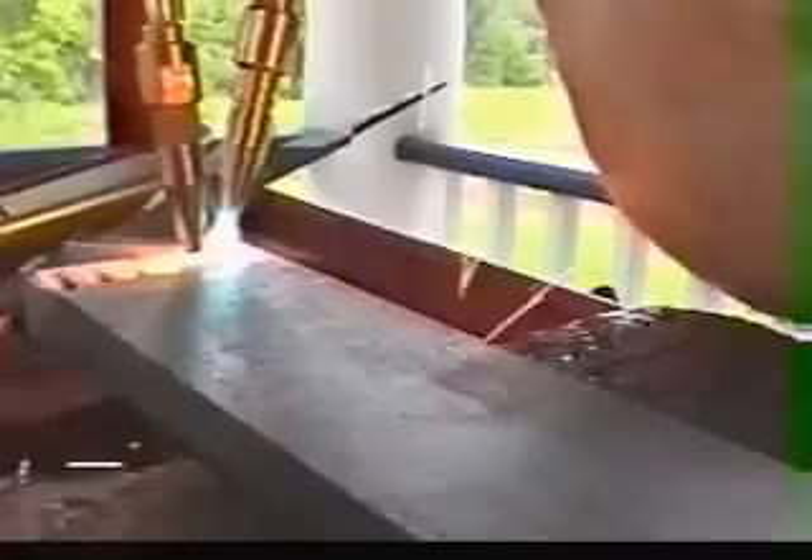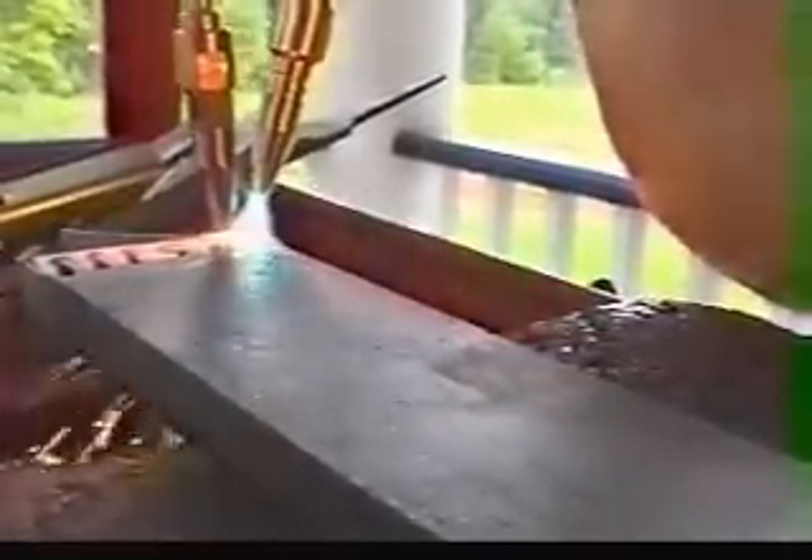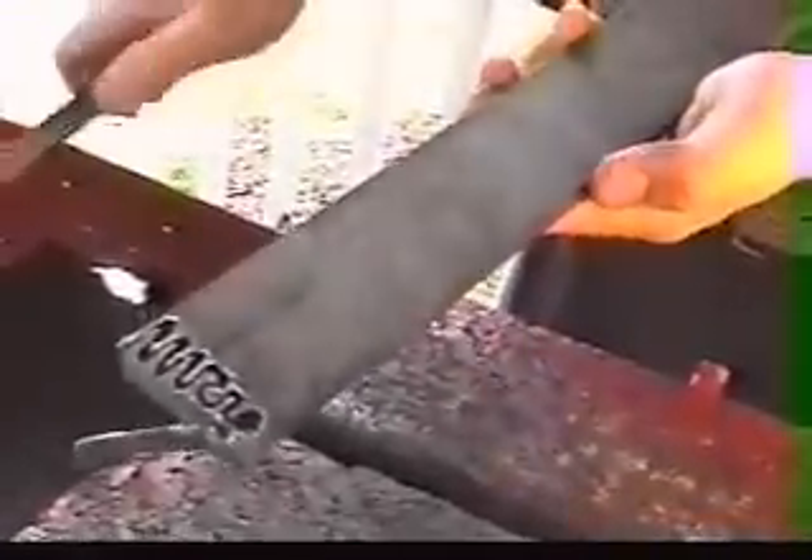Because of our two tips, you can do a lot of cutting with our torch that you would only be able to do with a plasma cutter. You can see just how clean of a cut that is — just a small amount of slag on the back side. And if you'll keep that tip close to the metal like we tell you, slag is just not a problem.